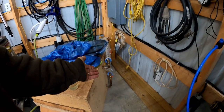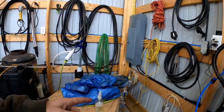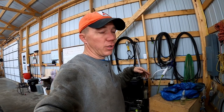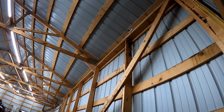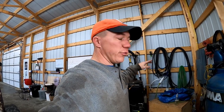We do have a heat exchanger in here from our wood boiler, which is literally right on the other side of this wall. That wood boiler heats our house and this shop. Right now we just plug it in when we want heat and unplug it when we don't. There's a thermostat set up here — it tells you the current temperature and you can set the temp for heat to kick on, or even air conditioning if you wanted. Once we have it fully insulated, we'll regulate the temperature to about 50 or 55 degrees — just warm enough that I can work without gloves on.